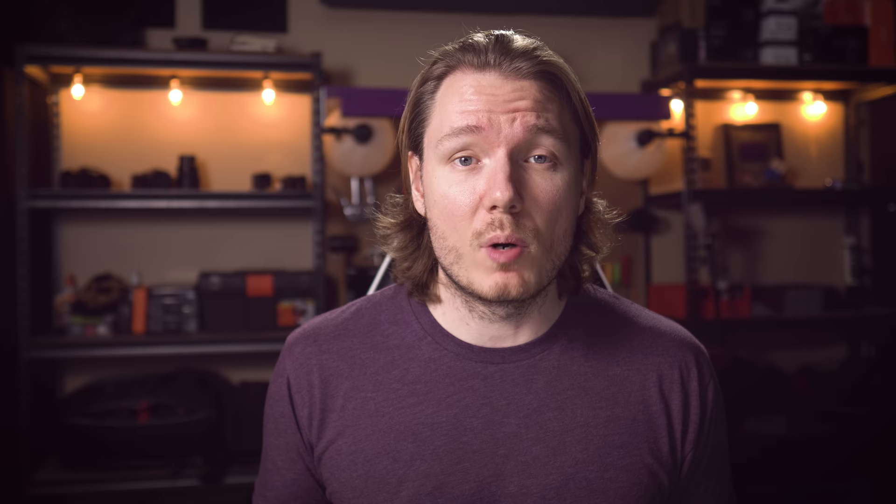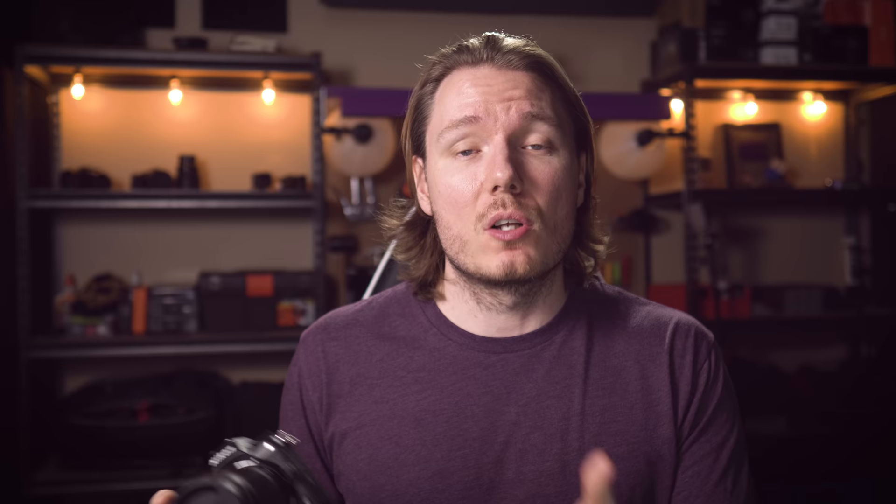Before we compare the processes, let's explain why we even need one in the first place. When you shoot video with a hybrid photo camera, the sensor isn't exactly configured to match the resolution or aspect ratio of the final video. Take the Nikon Z6 here again, which has a resolution of 6,000 by 4,000 pixels — a 3-to-2 aspect ratio. But Ultra HD video has a 16-to-9 aspect ratio and is usually 3840 by 2160 pixels. So the camera has to use a method of taking that photo-sized image and making it video-sized, and the method it's designed to use is usually based on the capabilities of the processor in the camera. Generally, the easier this method is for the camera to perform, the worse the end result quality will be.